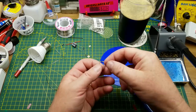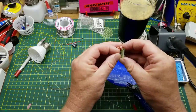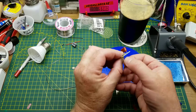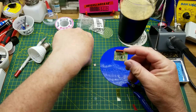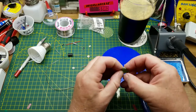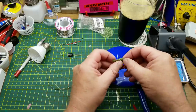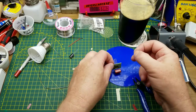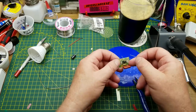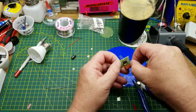Next, let's build the bridge diode rectifier out of these diodes here. These are just basic diodes — I didn't even look at what they are, four-thousand-and-something, probably. Again, it's not critical. Anything that can handle a couple hundred volts and a few tens of milliamps is all you really need for this circuit. Even though it is going to be attached to mains voltage, it's going to be inside that little plastic case so nobody's going to get hurt.